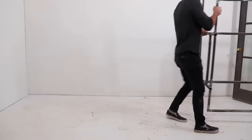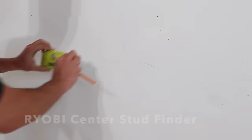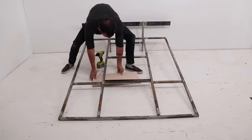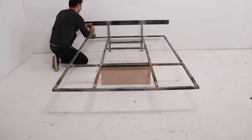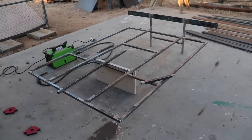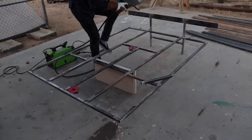I wasn't sure how much steel I would need to add to make the frame strong enough so I decided to do a test fit. I used my Ryobi stud finder to find the locations of the studs behind the drywall and then used a piece of plywood as a temporary leg in place of the acrylic. I screwed the frame to the wall and was able to see how much it would flex under weight. It was strong enough to hold but had a little bit too much flex, so I added in a few more pieces of tube steel to the frame.